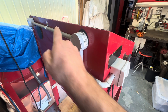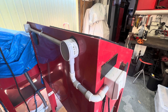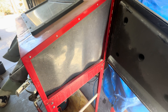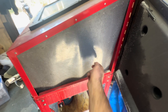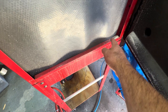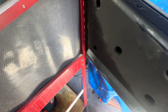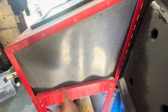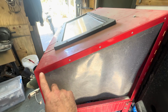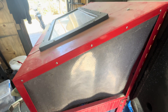These are all just standard electrical fittings siliconed in the back to try and seal it from any water. I'm not sure how long the lights are going to last, but they've been working fine and they were pretty cheap. Now inside the cabinet, I have put this curtain on - just a piece of whatever rubber I had lying around. No matter what you do, you get a lot of media build-up on the lip and on the door. Every time you open the door this all falls off onto the ground, so the idea is to contain it as much as possible with this curtain. It just clamps on via rivets drilled into the frame.